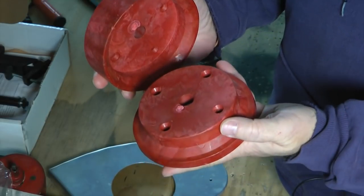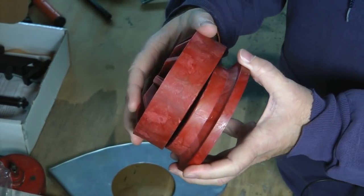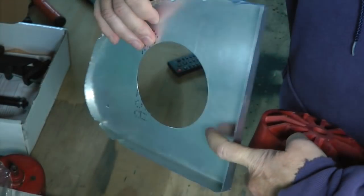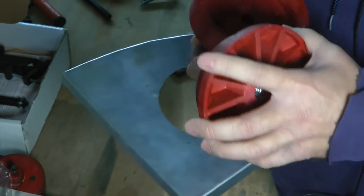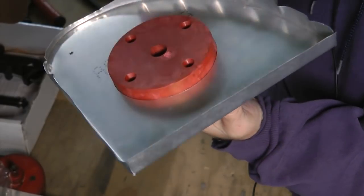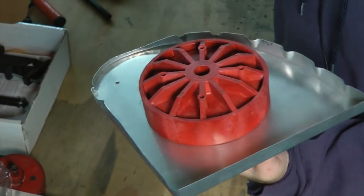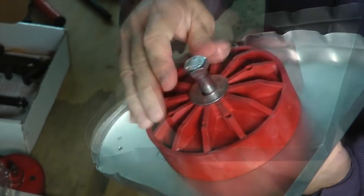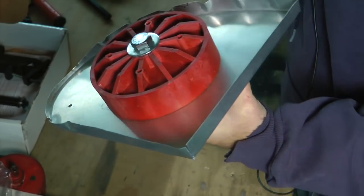If you make all of your holes either four-inch or three-inch, you have a relatively low-cost solution for the pressed type of flange. I have a nose rib here with a four-inch hole. I want the flange to protrude on the inside, so make sure the flange goes the right direction. The male part falls into the hole, and then the female goes on top. We go ahead with the bolt, thread it in — the other side has a built-in nut — and simply tighten away.